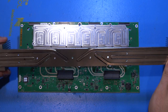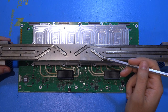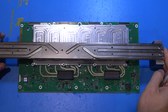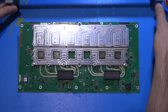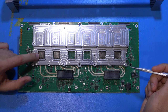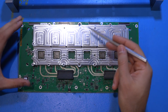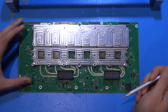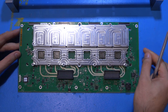Lifting this, we can clearly see the two-phase heat pipes connected here. There are going to be six of them because this is a six-channel instrument front end. There will be some thermal gradient across the front end because the lengths are different and the distances of the heat sinks are not the same, but that minor variation can easily be calibrated out — there are built-in calibration functions for that. Here's the front end — it looks really nice. These are the famous TEC061 front-end ICs, which do a lot of the functions. Two are not populated, so there's no reason to populate those channels if the connectors aren't there, since these are expensive.